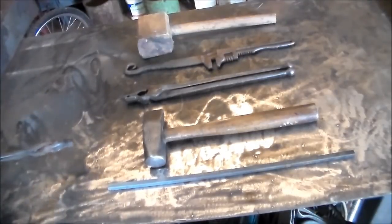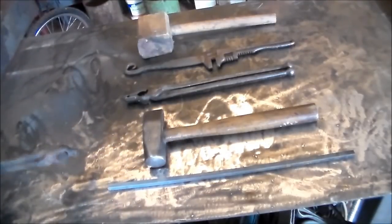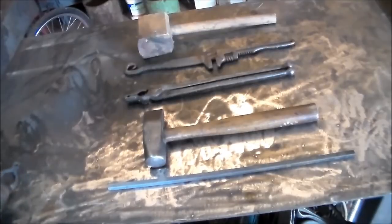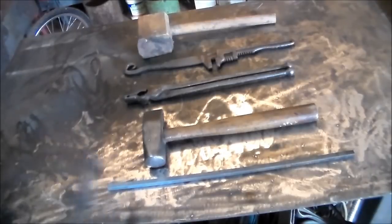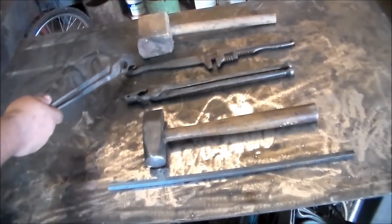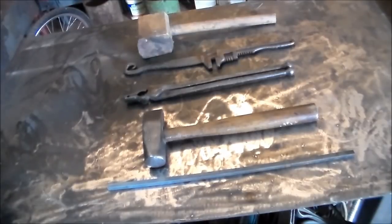Now, if you don't put a twist in it, this is all you need with a forge and an anvil to do the work. It is these two. You can do every bit of it with a hammer. But I put a twist in this one, so with that, you get a little shorter length of steel sticking out of the forge, so a pair of 3/8 tongs. If I had just worked the ends to put a handle and the flipper on, then I wouldn't have needed tongs, but with the twist I did. So 3/8 tongs, a twist and wrench with a vise for the twist, and because a twist or some kind of bend can get a little hinky, a wooden mallet.